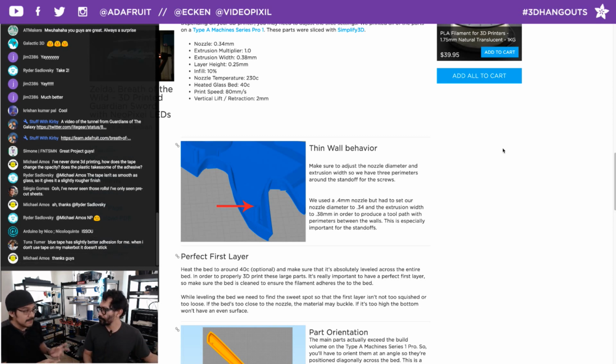There really isn't much infill needed here because it's just solid perimeters and top and bottom layers. That's all this geometry is. It's just walls and top and bottom layers. That's another thing that I did not mention. I do have 5 top layers and 4 bottom layers, I believe, just so there's no infill that's being created on the bottom. That'll show through.